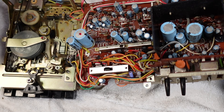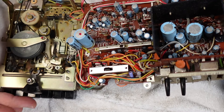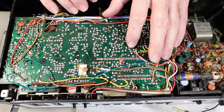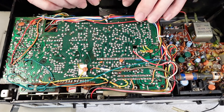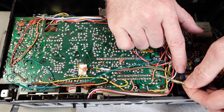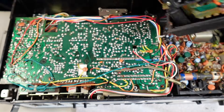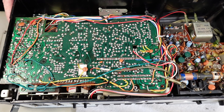So I'm just going to reverse everything that I've just done. Be mindful that you need to line the selector switch up with the correct part on the main board to make sure it actuates afterwards. But other than that I'm just going to get it back together. It's all back together - belts are in, everything's screwed back in, condenser mics are screwed back in and soldered on. Headphone board is back in, speaker cables are attached, everything's cable tied back where it's supposed to go, multi-plugs back on the radio board. Now rather than just swapping the aerial out, my donor unit has a perfectly good back case, all solid, all working, so I'm just going to drop that one on because the aerial is already attached.